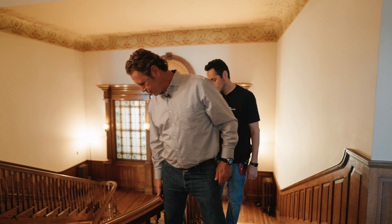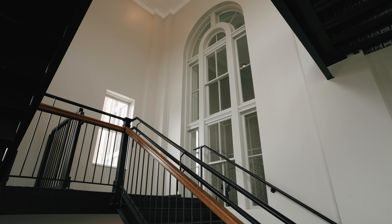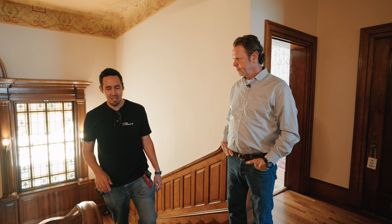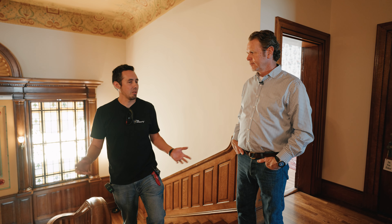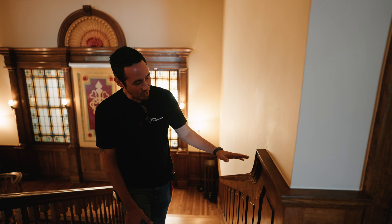The height of this handrail — don't get too close to it. Historically, just like this one, it's probably 30 inches, really low. Why did they do that? Because historically it lines up with the height of the pedestal on a column as it goes up. It looks beautiful, but if you did a really high one, like 42 inches, it looked like a cage, and all of a sudden this would not be as dramatic or as pretty. A practical way of handling this is to do a thin iron bar that goes up to code — brings it up to modern code, and it still communicates the beautiful look. I've actually seen that — that Georgian Revival house you guys built, it came up out of the handrail, a black rail, and it made it safe but still communicated the beautiful look.